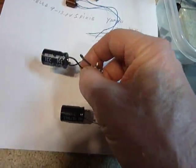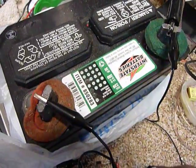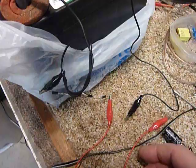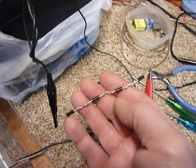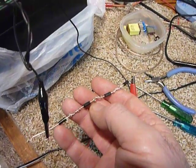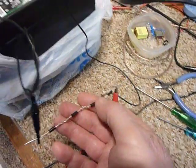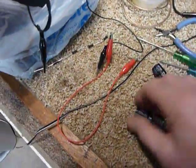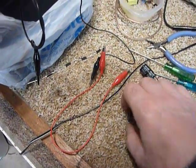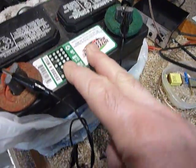I wanted to show you — the battery I'm using is the battery out of my lawnmower. I've got four of these — they are 2 amp silicon diodes. You come in on the unmarked end and the voltage comes out on the marked end. These are in series and four of them drops the 12 volt battery down to 9 volts. That keeps everything running cool in the Pixie, and I'd rather do that than be blowing finals.